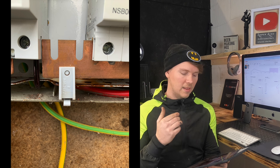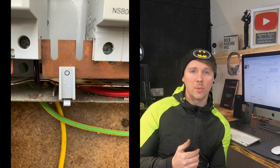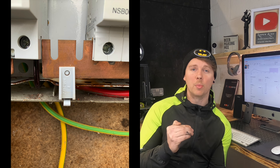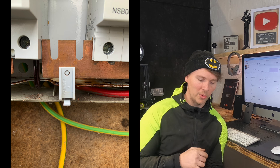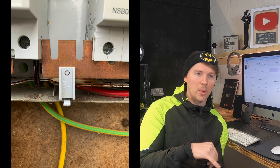Back to the fuse board. The picture shows you can physically see that the board below the busbar is actually rusting away itself. Water has physically sat in the bottom of that board to a point where it's rusted away - so you're looking at it going, it's not really suitable for its environment. Before we even tested it, looking through the regs book, red flags are coming up that this fuse board isn't suitable for the environment it's in. It shouldn't really be in an outside cabinet, especially one that's got holes in it and isn't sealed.